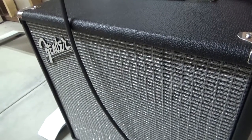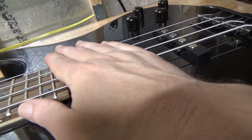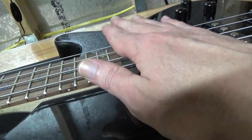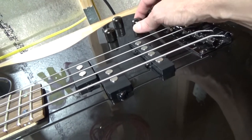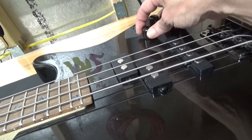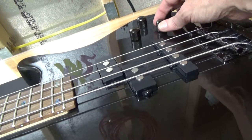When I plug in the bass and turn the amp up, I get a much louder sound at a much lower volume. The sound changes a little bit as I move the bass around, but it does not change based on whether I'm touching the strings, the bridge, or the cable. This is a bad 60 hertz hum, and it does sort of go away when I turn the volume down.